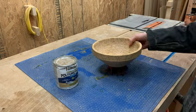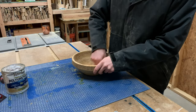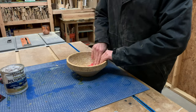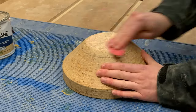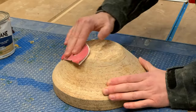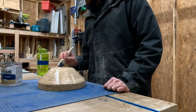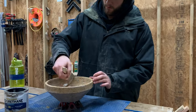About four hours later, I came back outside to give the bowl a light sanding with 220 grit sandpaper. This will smooth out any high spots and also smooth out any wood fibers that were raised from the water-based poly. I laid down one more coat, then after letting it sit for a few hours, this bowl was finished.